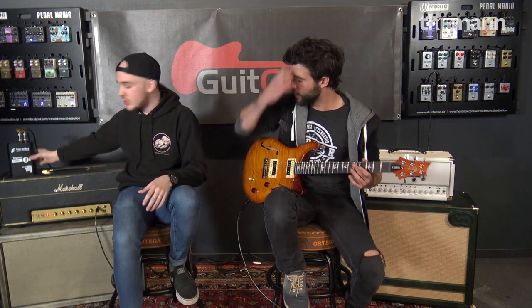So this basically allows you, even if you had something that's over 100 watts, you could still use this, obviously within reason. It takes 100 watt RMS, that's the key thing to mention as well. But should you go over, I mean, there are a lot of load boxes, and I know that a big gripe among a lot of common tube players, like the older generation, is that a load box could damage your amplifier. The best thing about the Captor is that it will never damage your amplifier.